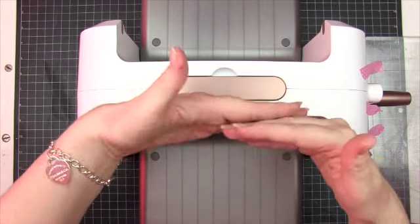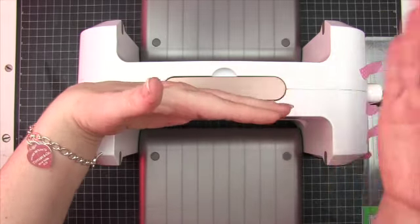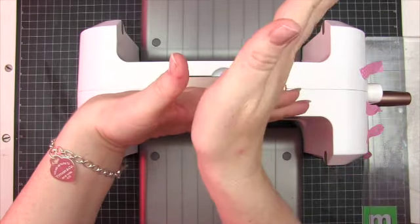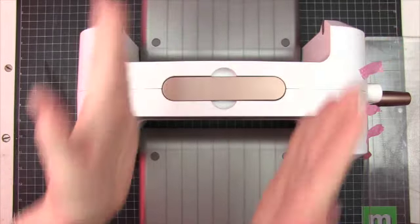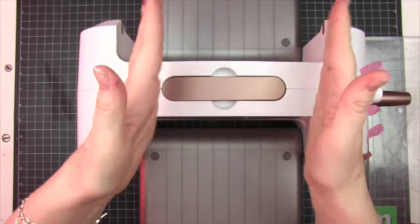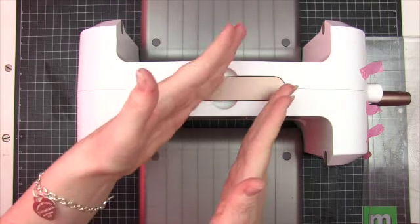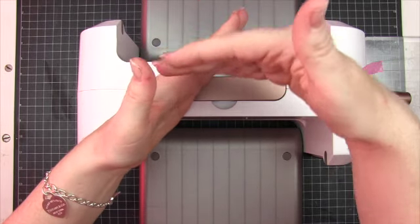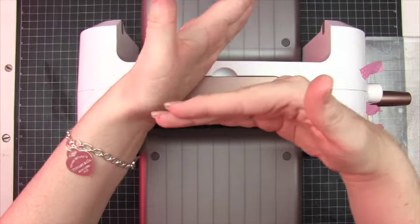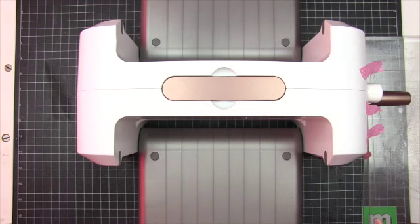So to stop that, you want to do the same thing as you do when you drive over those bumps in the car, if you can. You're going to go over at an angle. Now obviously you can't put your plates through like that, but you can put the plates like this and the dies like this. So then when it hits those rollers, it's hitting a point, and it's gradually building up across that plate, across that die, till it goes through at a much more gentle pressure.